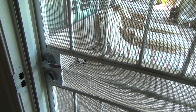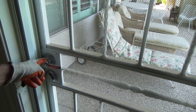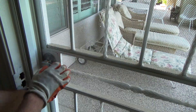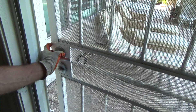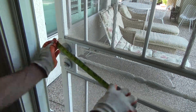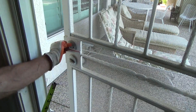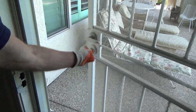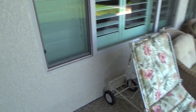I lift up on it and I can lock it, but who wants to do that every single time? They should have made these a two and three-quarter backset as opposed to two and three-eighths — it's so close your knuckles are right next to the edge. I don't know why they didn't do that. They should all have two and three-quarters, meaning from this edge over to the center, instead of two and three-eighths of an inch.